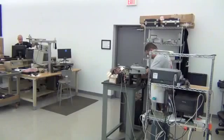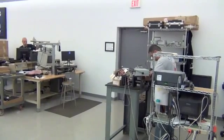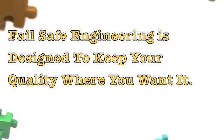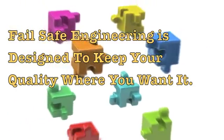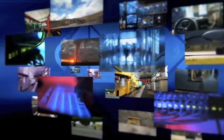Once the supervisor is notified, we recommend that the unit be checked to ensure that it is in calibration. And then, if it is, the supervisor need only access Torquetronics 2 via a hyperterminal program, and with a few keystrokes, the unit is reset, and now you can go back to regular testing. This kind of fail-safe engineering is designed to help ensure your quality stays exactly where you want it. After all, who do you want discovering that there was a problem? You or your customer?